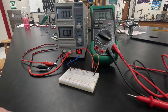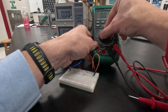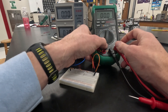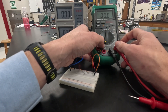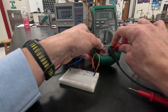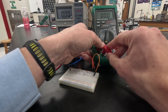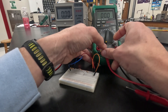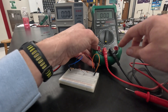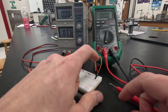Now I want to get my current reading, so I'm going to adjust my multimeter to read current. I'll change the dial over to 200 milliamps — I could go to 20 mil but at 200 it won't bounce around as much. When you do that you have to move your probe: since I'm at 200 milliamps I'm going into the milliamps port. If I were at 10 amps I'd go into the 10 amp port. If I leave it in the voltage port I won't get a correct reading.